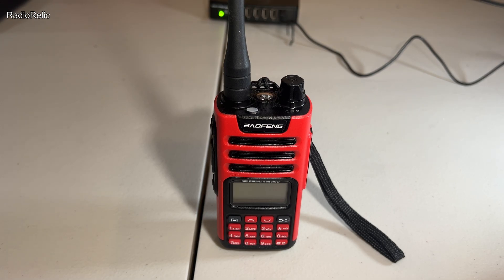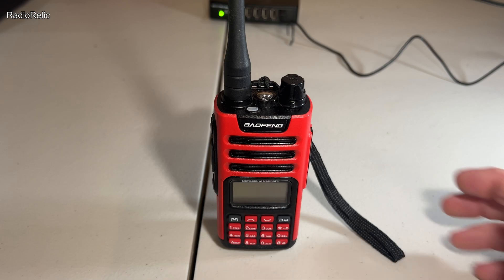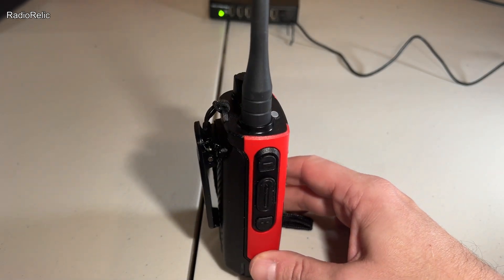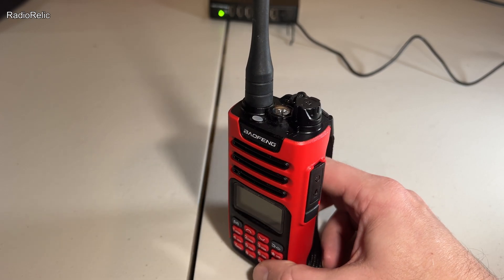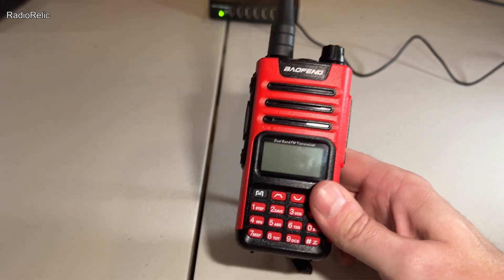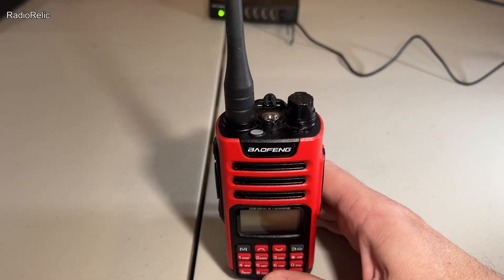I like that feature when I'm out with friends in a populated area where there might be other radios. Now if you're in an area like I am — I live near a mountain range in Colorado — they have a repeater up on one of the mountains within sight of my house. As long as I'm on an upstairs floor or outside, I can hit that repeater and talk to people 40 miles away. It's amazing, though that's really the capability of the repeater, not just the radio. But this is a repeater-capable radio.